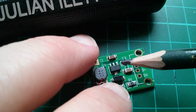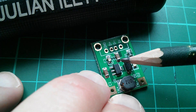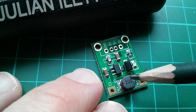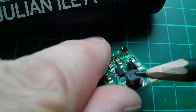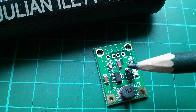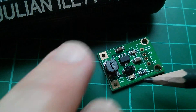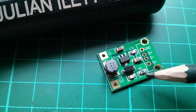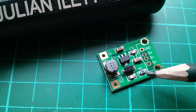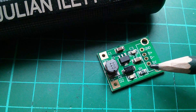It's based around this little controller chip in a SOT89 style package. It's got the number E50D, so we'll look that up in a moment. There's an inductor here - a little coil of wire wrapped around a ferrite bobbin - and a diode to produce the output. I was going to solder an LED on the output, but there's actually no point because it's got an LED on the board with a 222 resistor - that's 2200, 2.2K - strapped from ground to 5 volts.